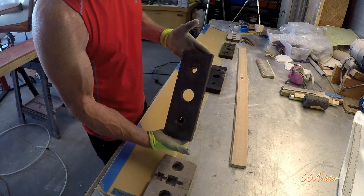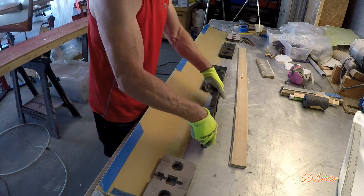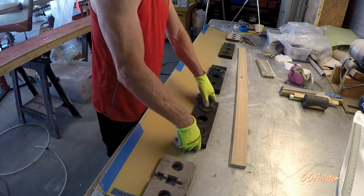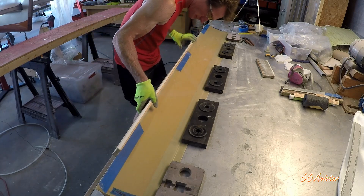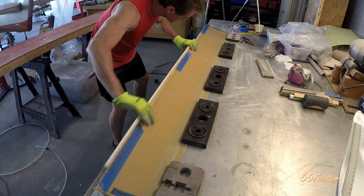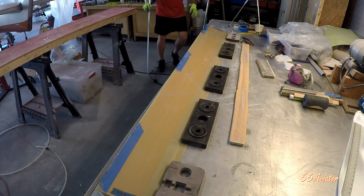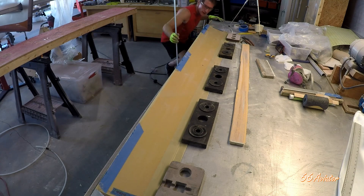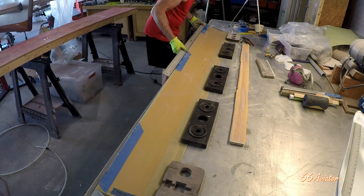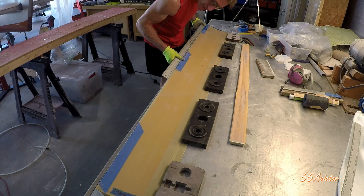These are weights off an old weight bench somebody was throwing out, so I grabbed a whole stack. I've got 200 or more pounds of this stuff and it's perfect when you need it for jobs like this. The best thing is if you can gun-sight this by looking down the piece — your eye is usually about as straight as you're going to get. But if you don't trust your eyes, just get a scale from a hardware store to check for your high spots.